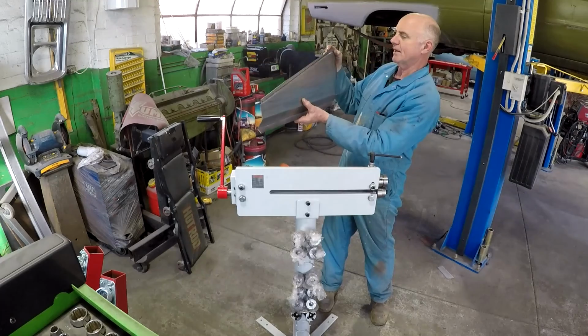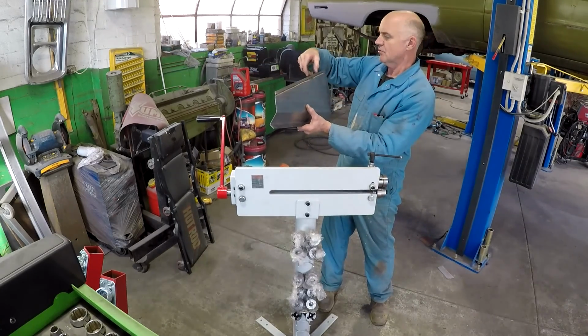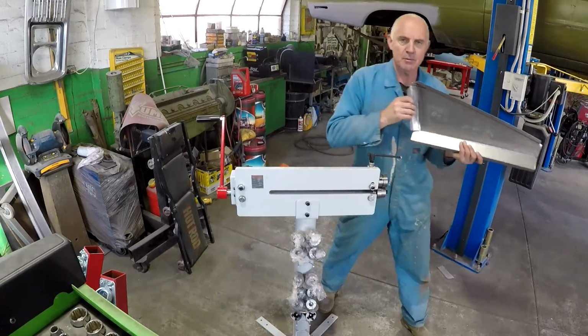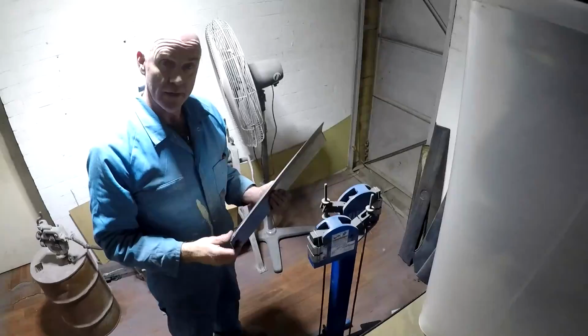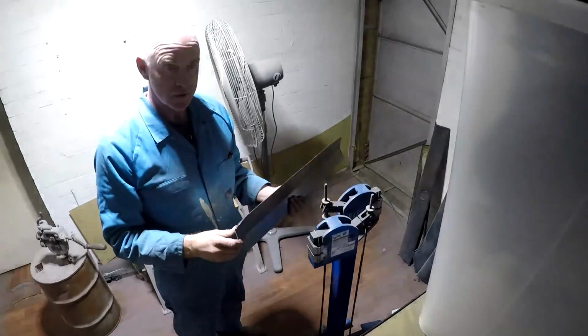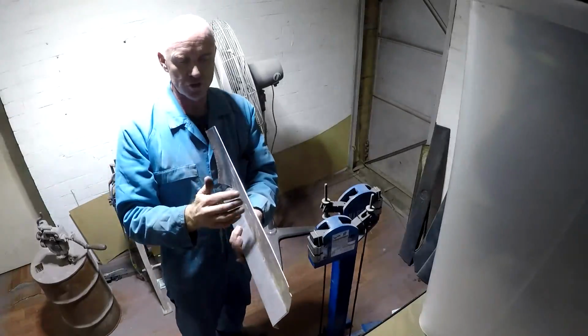It's not perfectly straight, unfortunately. Doing it by hand is a bit hard on your own, but it won't matter. As long as you get the shoulder in, it ends up flush. You're going to put a bit of smear, a bit of filler over it anyway. It's not going to be filler free. Okay, now we're getting much closer, a bit at a time. So now the panel line here is a bit too straight on my patch piece.